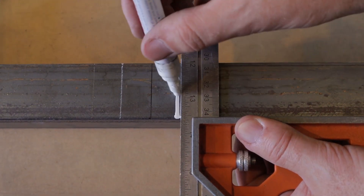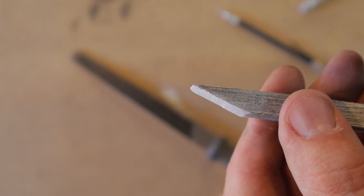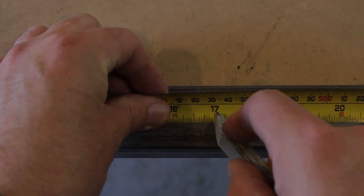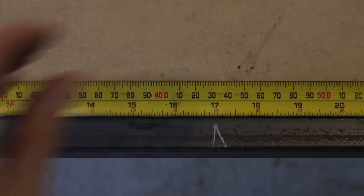When marking out on carbon steel you have a couple of choices: a scribe, engineer's chalk or soapstone, permanent marker, or paint markers. Soapstone is the most popular in the trade — it's very accurate if you keep it sharp with a file or grinder, it works great on rusty steel, and when you find it in the bottom of your washing machine because you left it in your pocket, it's ready for the next project.